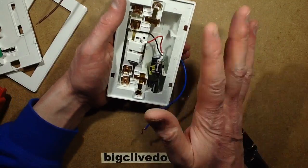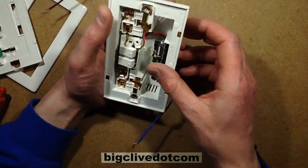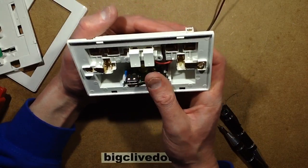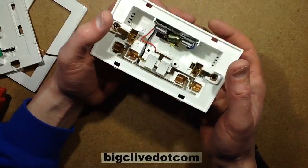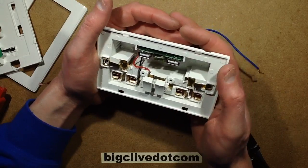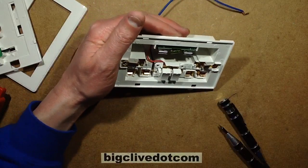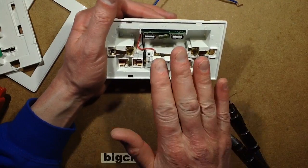I'm not really keen on them building stuff in, because ultimately when this fails all you're going to do is end up with a socket with dead electronics in it, just sitting cooking away in the wall. If something went wrong with this - if the plastic started discolouring, smoke started coming out, or there was that nasty smell - it's not a case where you can just go and unplug something. You can't just remove the power supply - it's built in.